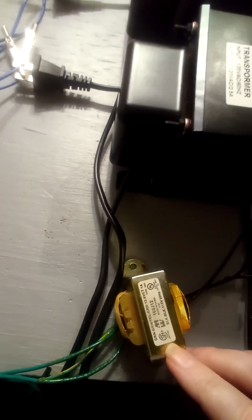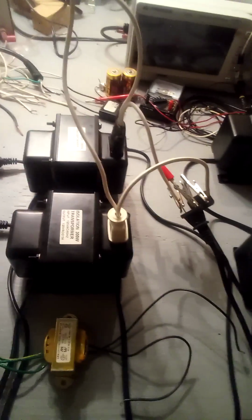Okay, later I'll be using these. I have lots of these, over 10 of them. They're 10-to-1 step down transformers, but they put out about 15 volts each. So we need 8 of them to make 120 volts. Then I would need 8 of these, and 2 more of these would be 10 altogether. And I do have 10, but I'm about to order some new ones. Would be ideal.